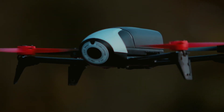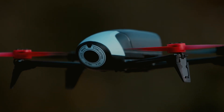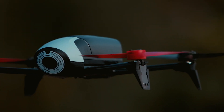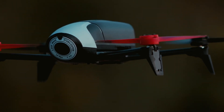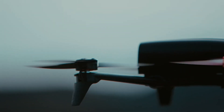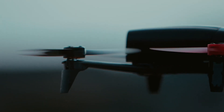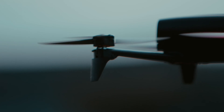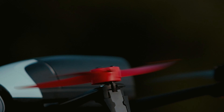I believe it is the propellers causing the issue. When I swapped the propellers around to different corresponding positions — counterclockwise and clockwise — moving them across to the other blade and the other blade back, I managed to replicate the steadiness. So I think I've improved the flight of the drone to some extent and the video is getting better now. I don't have as much jello as before. On soft flights, absolutely no jello. I only have jello at full speed, but even good Bebop 2s have jello at full speed from what I've heard and read.